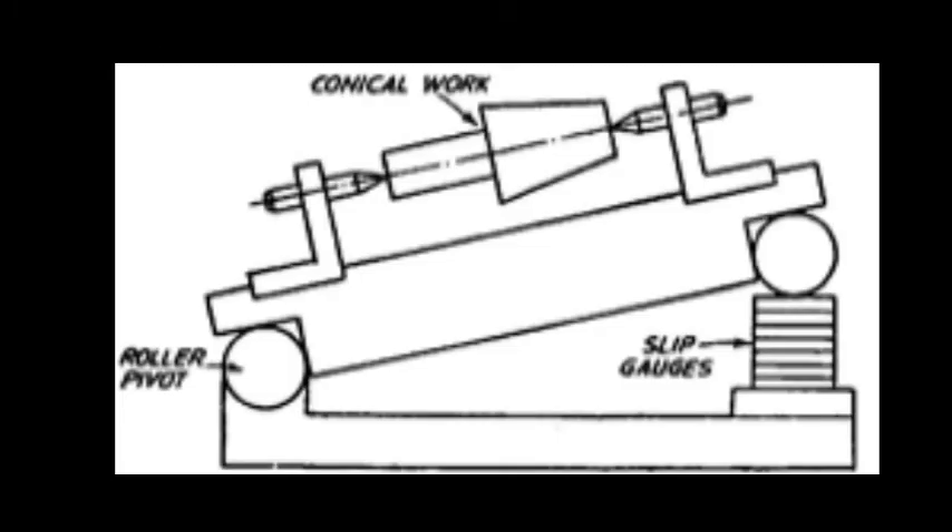The sine table is the most convenient and accurate design for every workpiece. The equipment consists of a self-contained sine bar hinged at one roller and mounted on its datum surface. The table is quite rigid, and the weight of the unit and workpiece is given further safer support. The table may be safely swung to any angle from 0 to 90 degrees by pivoting about its hinged end. The use of sine centers and sine tables provides a convenient method of measuring the angle of taper plug gauges.